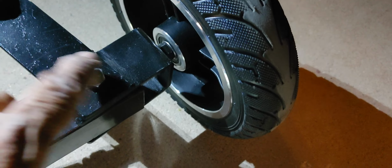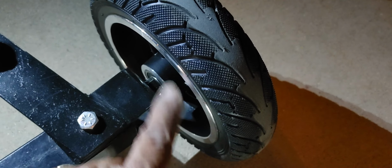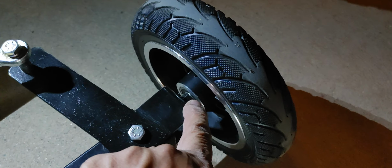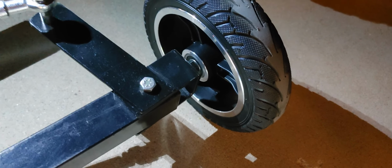It's not cheap, but I am so glad I did it, because even though this was a little bit of work, I sliced this just a little bit, almost halfway down the thickness of the stock to get it to bend, but it was cracking, and so it didn't fall off. That's a good thing that it didn't fall off, so I still had the bend, and the part was still in the C shape. And then I just came back and welded the outside and the inside, put some nice beads of metal there. The same thing here, I welded this on an angle there to establish the anchor, man, that's giving me the